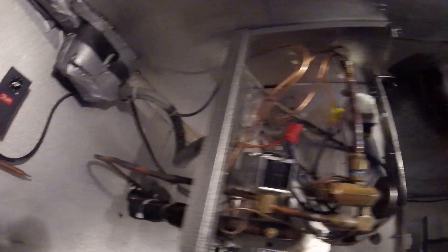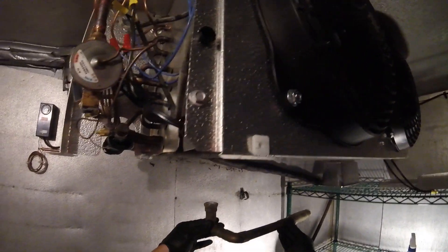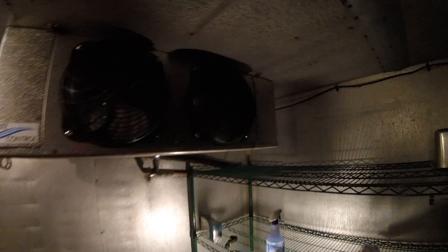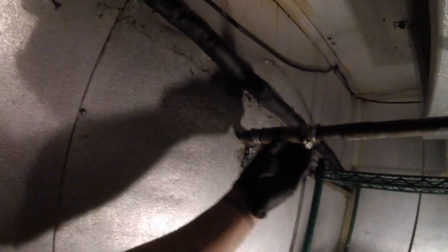The timer. There's already a standing charge in here. From here, I'm just going to charge the unit properly — make sure the sight glass is clear. I'm going to put on the bottom pan, hook up the drain, and we're just about finished here. That is one successful blower installation. A little Teflon tape on our drain — we're ready. I'm going to pour some water down the pan to make sure there are no leaks. Then top off the charge. We're ready to go.